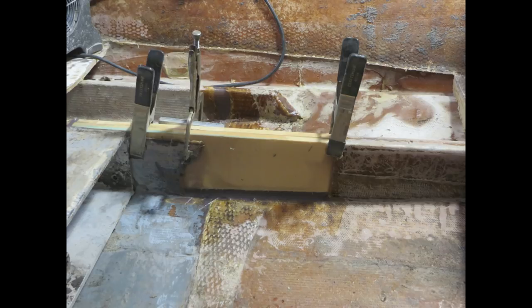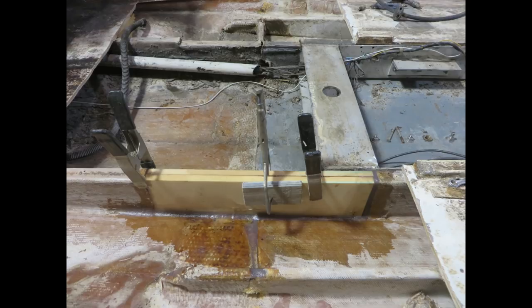I've shaped and formed a replacement stringer section from high-density foam board, bonded into place with a thickened resin solution and clamped in place. After the blocks have cured, I wrapped these in glass — 1708 biaxial fabmat, two laminates on the inside, one on the outside, and a fourth laminate draped over the top running down both sides. This will lock that stringer in solidly.